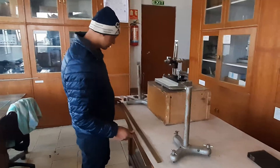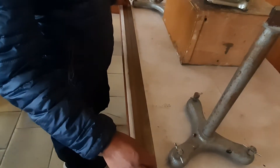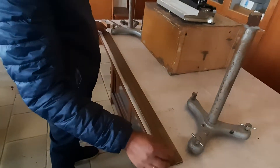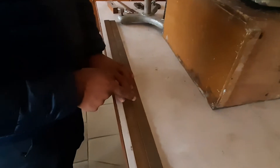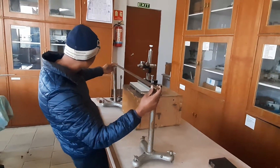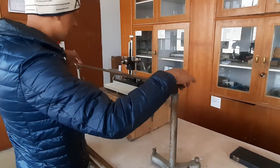Using the meter scale we can measure the length of the bar. We mark three positions on the bar — for example, if we want a working length of 90 centimeters, we leave five centimeters on each side and mark the midpoint as well. We then place the bar on the sharp knife edges of the stand, ensuring the distance between the two support points is exactly 90 centimeters.